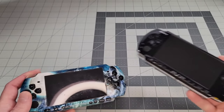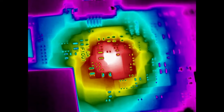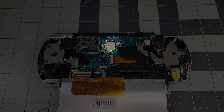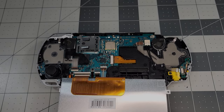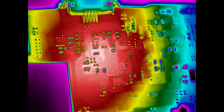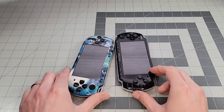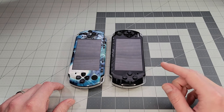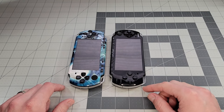Sadly, we still have two broken PSPs. I think in both cases something is definitely shorted internally to that large chip, which means they'd need to be replaced. But at that point, you might as well just put in a whole new motherboard since you'd need one to get the part anyway. I promise, in my other videos the repairs are successful. Even though I couldn't get these going, I thought maybe others in the community could take some insight from it. Thanks for watching, and next time I see you we'll have a happier ending. Take care.